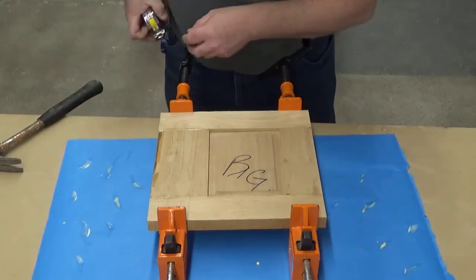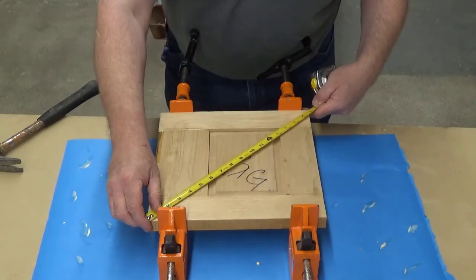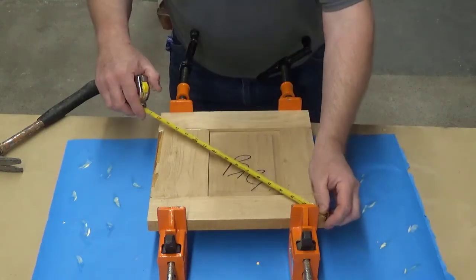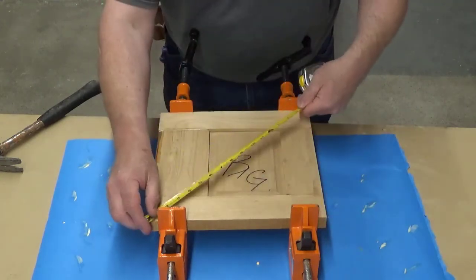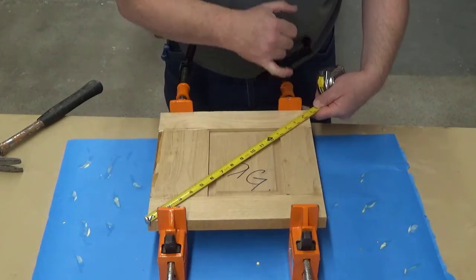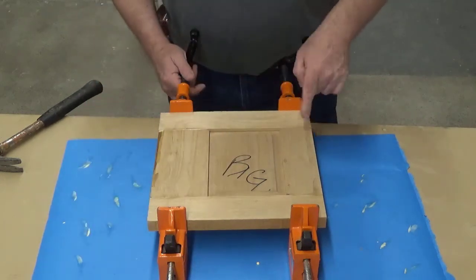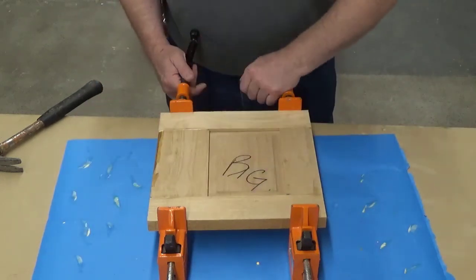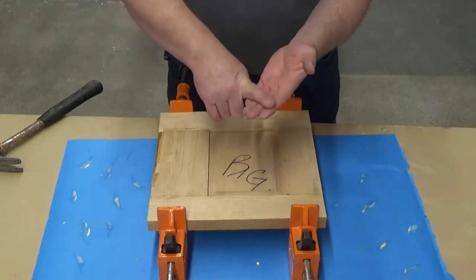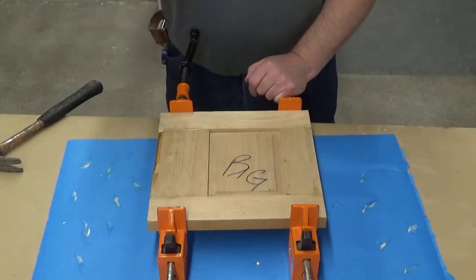It's all tight. Now I check my diagonals — 7/8 that direction and a heavy 7/8. So actually it's just very light — this is within reason. If you're off the width of one of these marks, that's just splitting hairs and not necessary. We are going to go back and square all four panels — your front, your sides, and your back — after everything is dried and sanded through the white belt.